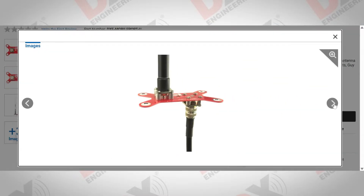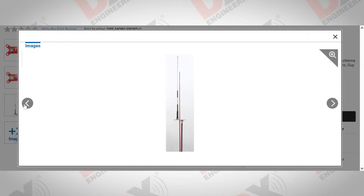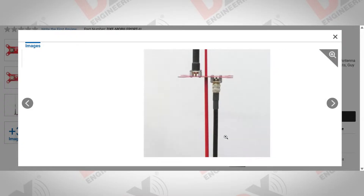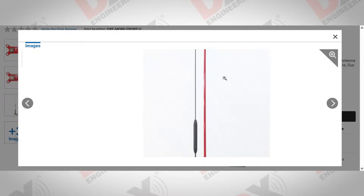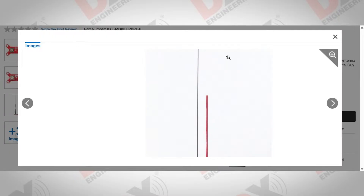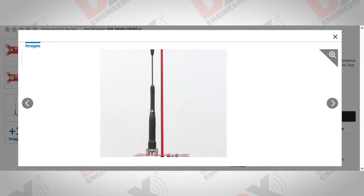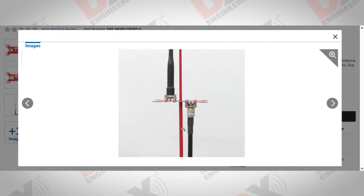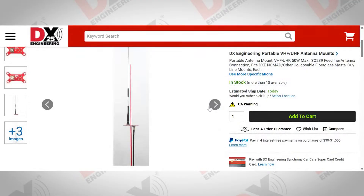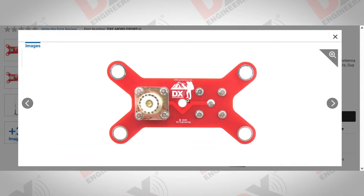We have come up with this mobile mount antenna that fits on top of our Nomad masts or any similar fiberglass telescopic mast. The center hole feeds right up through the middle of it — you can kind of see the red mast there in that second picture. It uses any of the radial-less design mobile antennas. Comet has some, and Diamond has some really nice high-gain non-radial VHF-UHF antennas. This allows you to get your VHF-UHF antenna 20 to 23 feet in the air at the base, making portable operations much easier without a larger mast and base antenna.